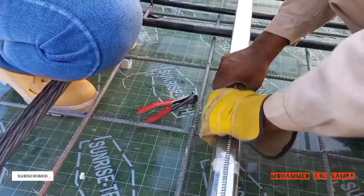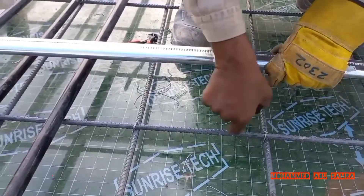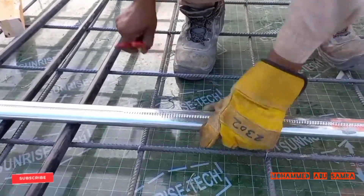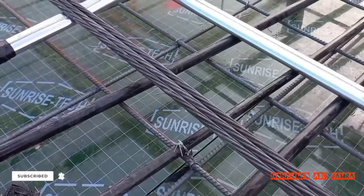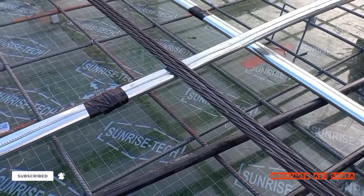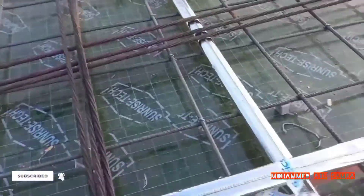Then we are going to make masking tape around this joint. Why do we do masking tape? We do masking tape to avoid concrete going inside the tendon during concrete casting. We should make this masking tape properly. If concrete comes inside the tendon it's a problem — we won't be able to make injection after we finish the system, it's closed.